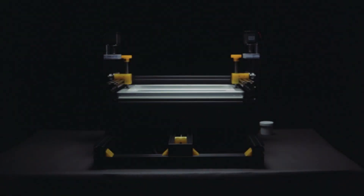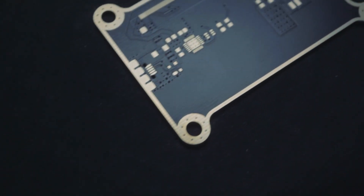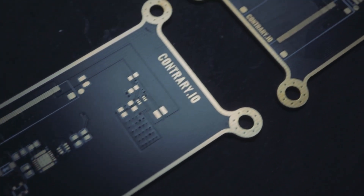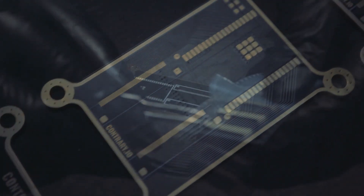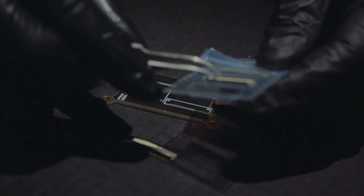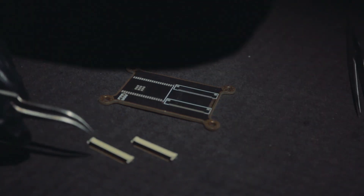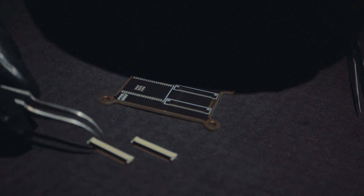This is the first version of the stencil printer I'm making. I made it because I was having some problems getting a good yield on the FPC base PCB series that I'm making. It has two FPC connectors on each board and these FPC connectors have 40 pins each with 0.5 millimeter distance between each pin.